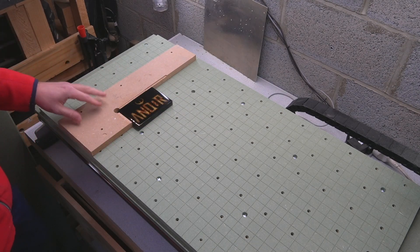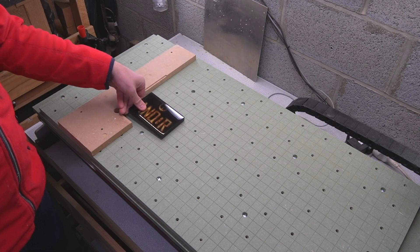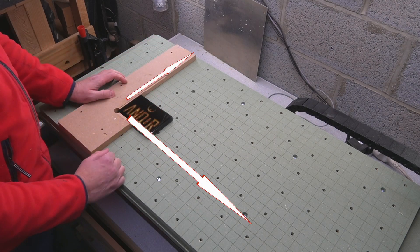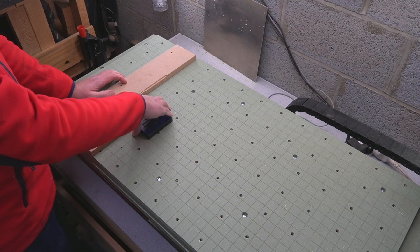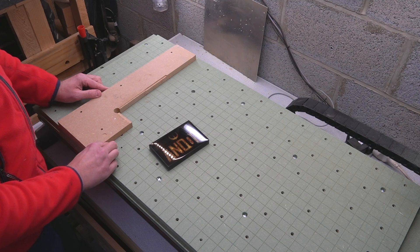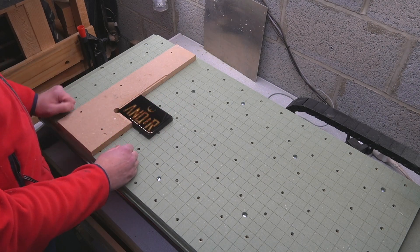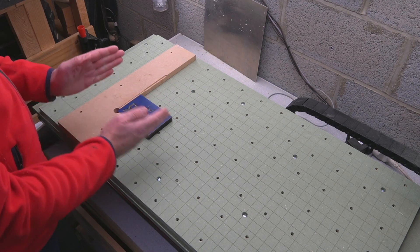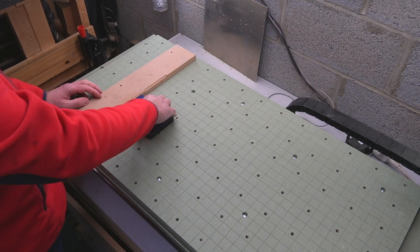It is very important that I use something like that, especially when you make two-sided jobs. You have to make sure that they line up perfectly in both axes on your machine, and when you turn them over, that you get exactly the same zero point. So it's very important that the jig is completely square compared to the machine, but also that the zero point you've measured is very accurate. You can reference the lower left corner of the piece when you turn it over, because if you have a difference and don't have the right zero, then the two sides of your piece will not be aligned.